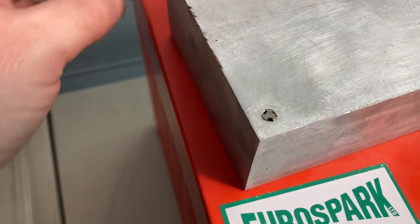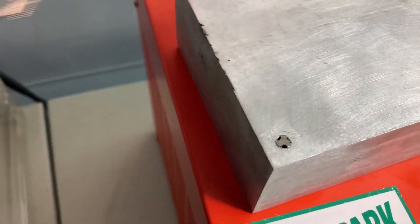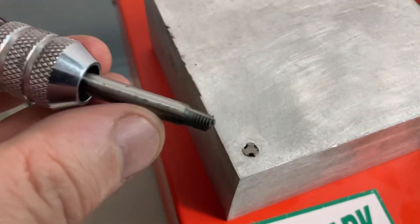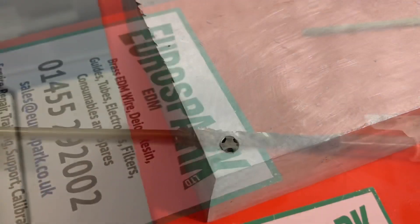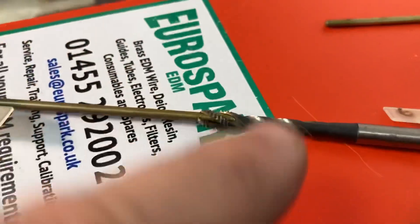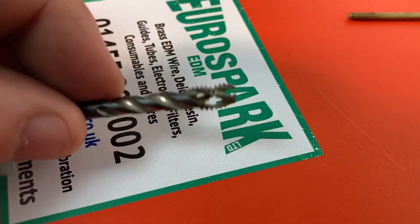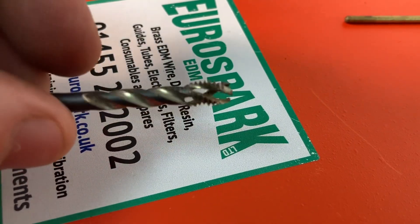It's just as easy for me to set it up this way. This hole is about 20mm deep, and the tap itself broke off about 15mm into that. What we're trying to do is erode through the core so that when we remove the electrode, we can just pick these flutes out of the threads without damaging them at all.